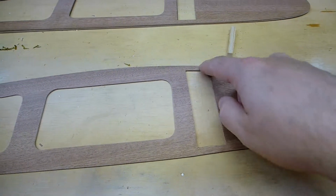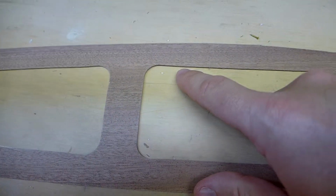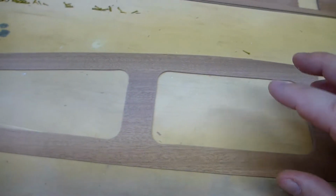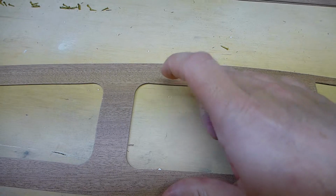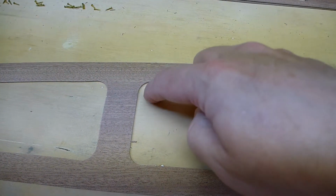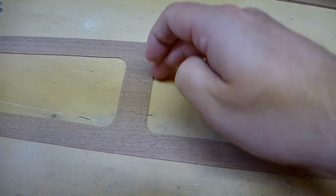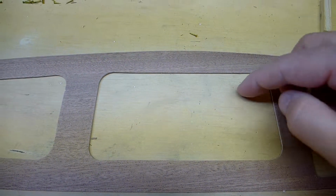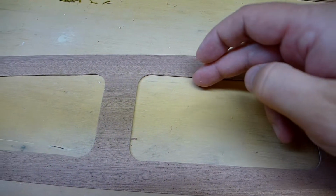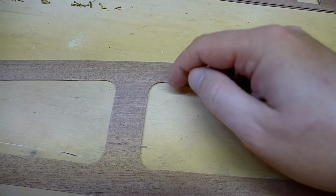But once you start cutting, and I did that with a chisel, you need to fiddle with it to get it to fit over the spars. And I'll discuss how I got these lined up a little bit more in just a minute here. And then I just took a Forstner drill bit, I think it's maybe 3/4 of an inch, drilled holes in these 4 corners, took a jigsaw, cut between them. And that's probably the most important part to make this easy, is to be careful as you cut to get it lined up nice and even with this curve.